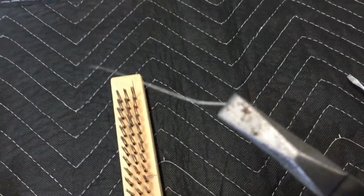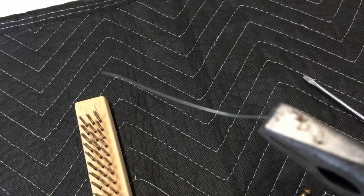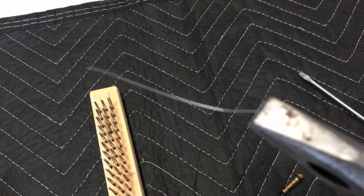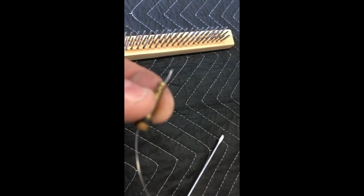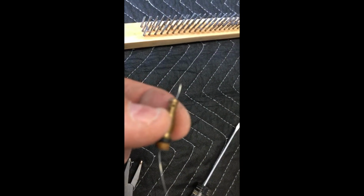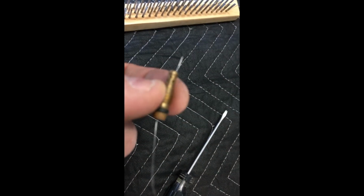Yeah, you should be able to see this pretty good. This is a strand of stiff wire that I pulled out of this wire brush that is a really good diameter for cleaning out this jet. So this is what I tend to use. Here you can see that strand of wire goes through it. I'll just run that in and out a few times to clean up that hole, and then we're going to give it a good squirt and then return to service. Reinstall.